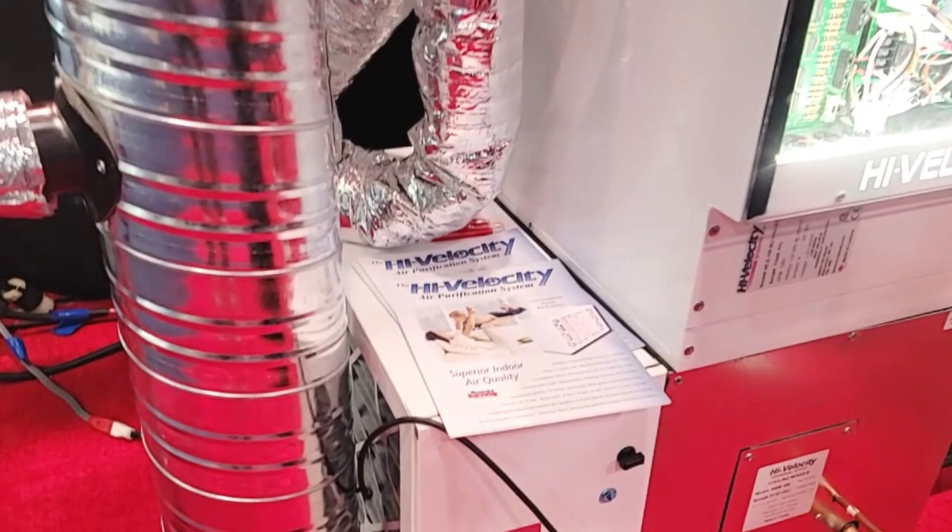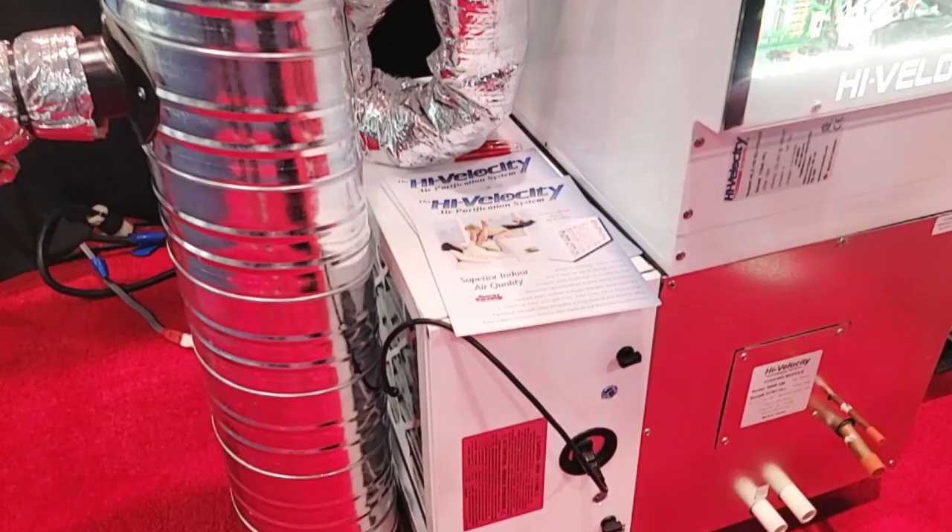So let's talk about your air purification product. I see you've got a MERV-13 filter on there? Yeah, it's MERV-13 or MERV-14. There are three different stages. The first stage is just a particulate pleated filter — I think it's three inches. The second stage is UV lights. The third stage is a titanium catalyst. The UV lights positively charge viruses, bacteria, COVID, smoke smells, and other things like that. The titanium catalyst will neutralize those things — it doesn't kill viruses, it neutralizes them so they can't reproduce. And it works great on smoke smells from forest fires as well.